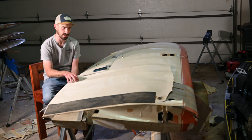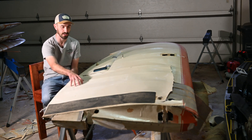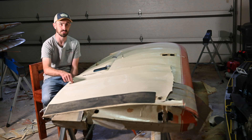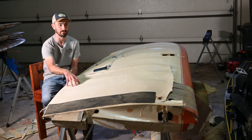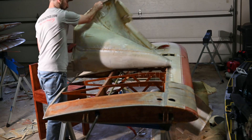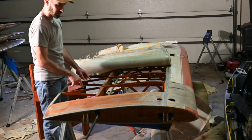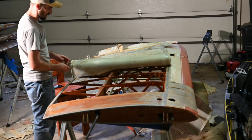One thing about it is, if you look at the top of this fabric, it actually looks like it's pretty good. It'll crack when you bend it, but a lot of it looks okay. But when I've taken the other three wings apart, some of the things I've noticed is the wood's rotten in a spot or two, or something had some water damage, or there were mice in there. So even though the paint and fabric may be great, that doesn't necessarily mean everything's going to be good. I've already started removing the fabric and I'm about halfway down the wing. Whenever you have the fabric installed, it's stitched to all the ribs, so I have to go through and cut each individual stitch to get the fabric off, then pull it around the leading edge and trailing edge.